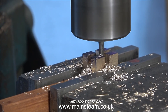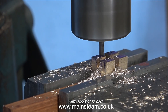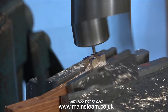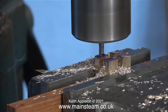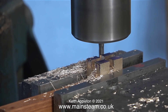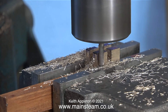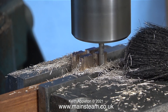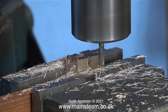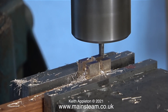After cutting the longitudinal slot I cut the transverse slot in the same way. For both of these slots I set the depth of the cutter a tiny bit above the vice jaws. To cut the transverse slot I just used the depth stop so I couldn't go any further and mark the jaws. On the drawing this slide valve is shown with a gap milled all the way around it, but it doesn't really need to be there — you could leave it out. But it's always a good idea to reduce the mass of reciprocating components, and it makes the slide valve look better too.